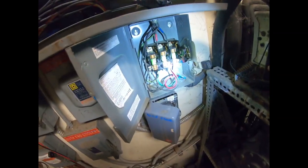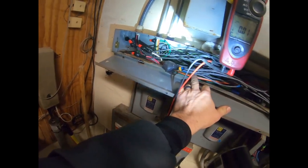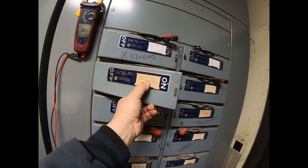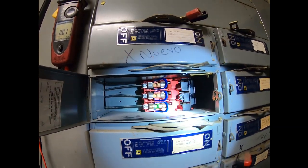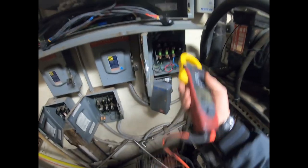We've got it coming in there, comes up to this unbelievable mess. That one there and the other leg's back here - I assume this is over here but none of it's labeled. It appears this one says 'comps something,' can't read it. The bottom one there that's green was replaced once before, not the other ones, so all three should have been replaced. I'm going to assume if we kill it and go over here and see if this one's dead, it'll tell us whether that's it - and it's dead. It appears that's powering multiple different ones.